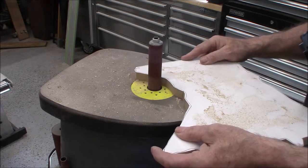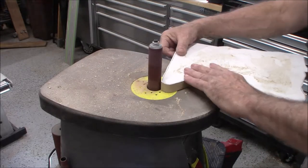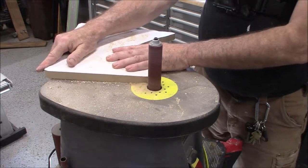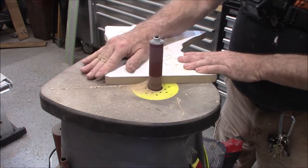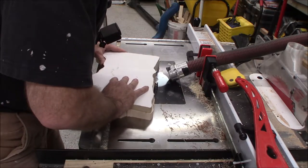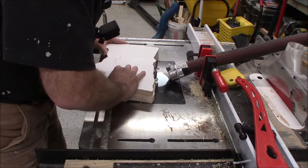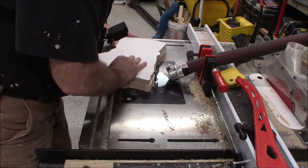Then from there, I took it over to the oscillating spindle sander and cleaned up the edges and came up with a little bit more even surface that I could work with. And then from there, I transferred that over to the cutting boards, drew those out, and cut those out, same as I did on the bandsaw. Then I used double face tape, stuck them to the back of that template, put them into the router table, and used a patterning bit on the router table to even it all up,